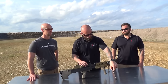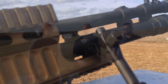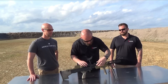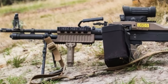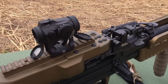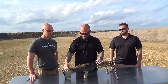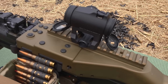On our lightweight bipod, we've now moved the bipod off of the barrel and onto the receiver, and we've added QD sling swivel sockets onto both sides of the bipod legs. The hand guard is one piece aluminum, machined, with a bottom rail on both sides and both side rails. For the rear sight, we've gone with a regular rifle-type rear sight as opposed to the old bladed pistol sight like on an AK or a 1911 target pistol. Going into the top cover, also machined aluminum with the top rail so you can mount any kind of optic you need to.